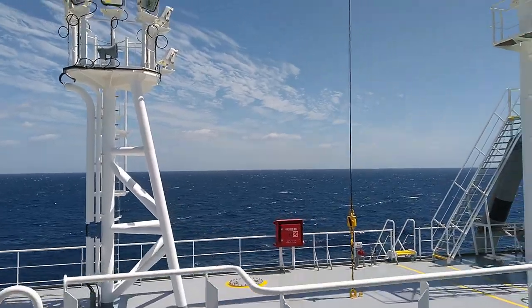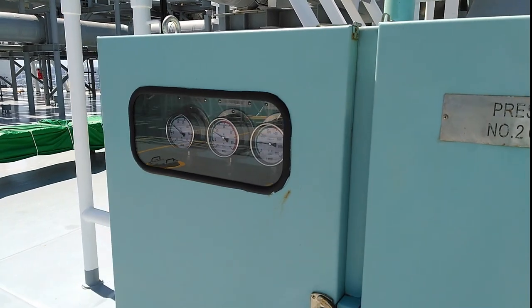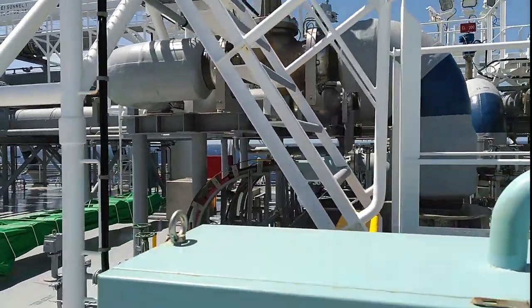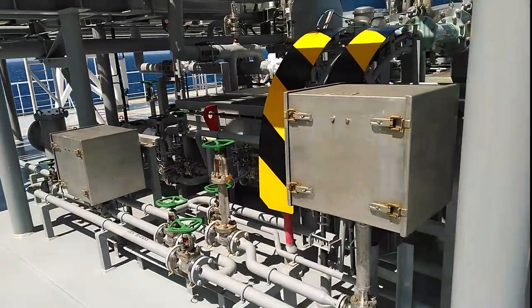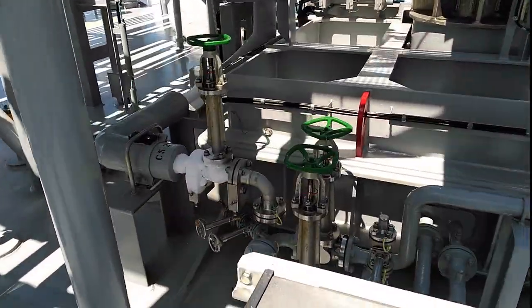The reason we need to check this is that in case of leakage, entry of LNG into a warm tank may damage the tank, and as a result you will not be able to perform cooldown and will not be able to load cargo afterwards.